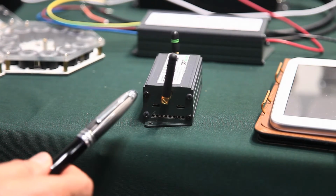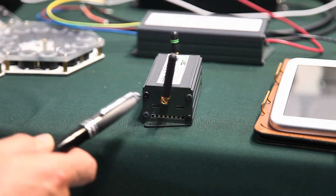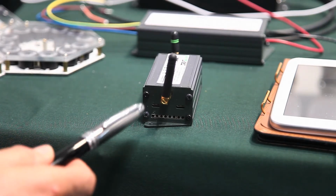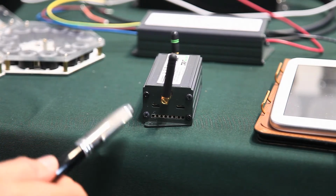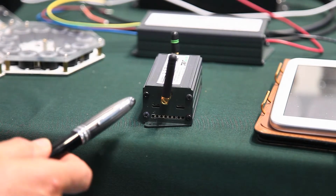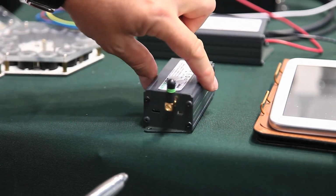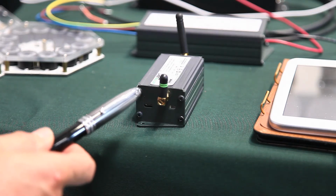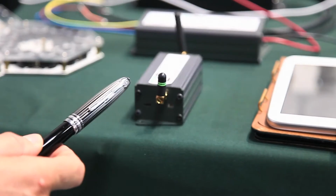We have adopted 2 types of communication protocols. The first one is a long-range solution, proprietary to Metrolight, which provides 21 kilometers range in outdoor areas, or 2 kilometers inside constructions, buildings, or whatsoever. We guarantee the communication, and this is the idea. If there is a Wi-Fi communication in the area, we have the option of Wi-Fi communication, and in this case, it's a very simple connection, with no need for a gateway to control the DLDs.